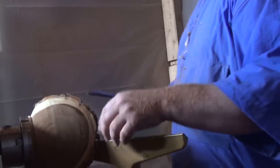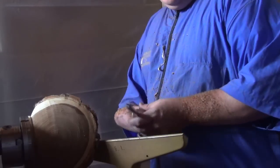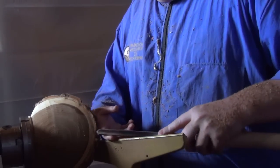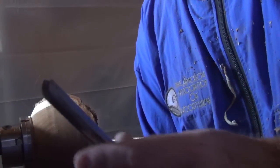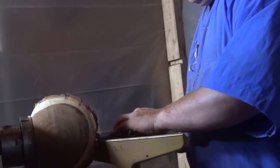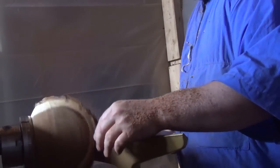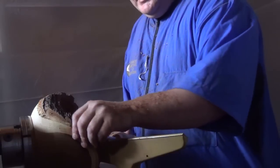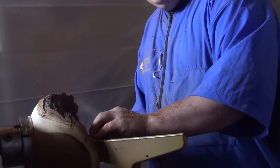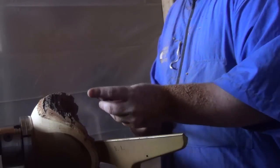Hey, I'm gonna probably turn this on a couple more times. As I'm coming into this inside wall that I'm cutting here, I'm hitting this part of my bevel. Let's see if I can get that to focus there. This part of my tool, as I reapproach, what I do is I come here and just gently start nicking it against that. As it's spinning, it starts to nick it. Then I slowly turn it. I don't open it up yet to cut, I just run it down so I can feel if there's any imperfections using the backside of that bevel.